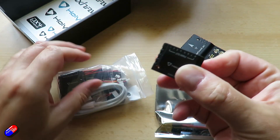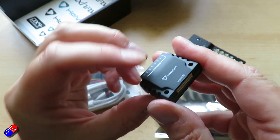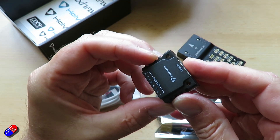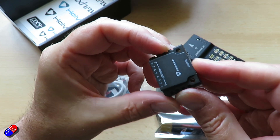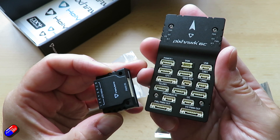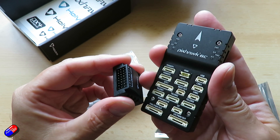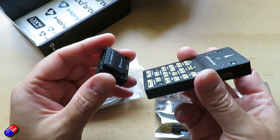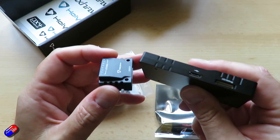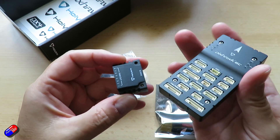This one ships with a version of PX4 installed, because at the moment as I'm recording this, the Pixhawk 6C has support in the PX4 master. You're going to have to use the latest daily builds for QGroundControl, and just like when I had the Durandal it's come out a little bit before the code is fully available, so you're going to need ArduPilot 4.2.3 for this to work — but hopefully that should be out soon.